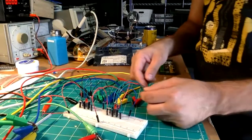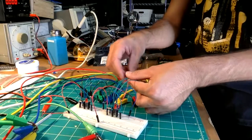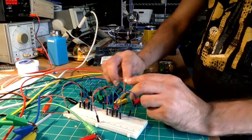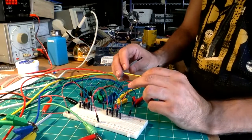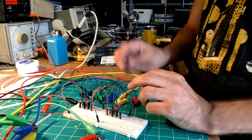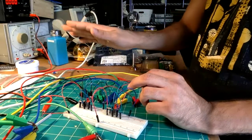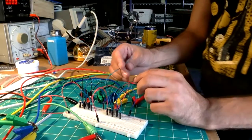And I was tinkering around with, okay, what do I do with these? Last time when we were working with it, the potentiometer connectors for oscillator 2, when we connected the potentiometer, it did nothing. It didn't have any output. And I think it actually made oscillator 1 just stop.